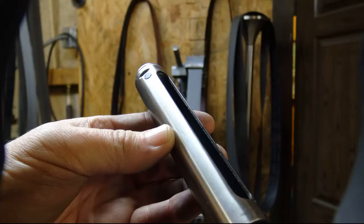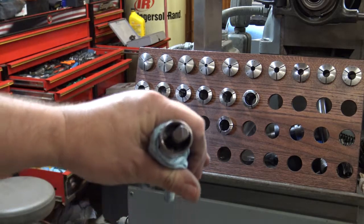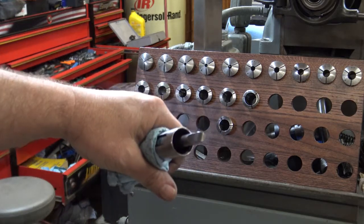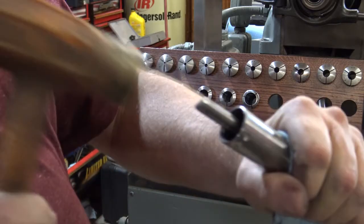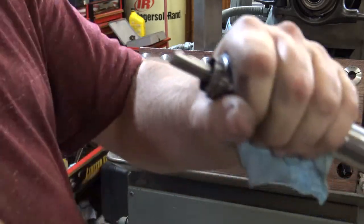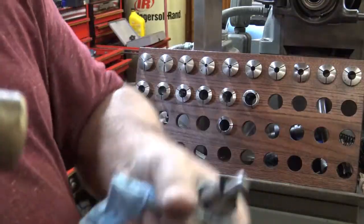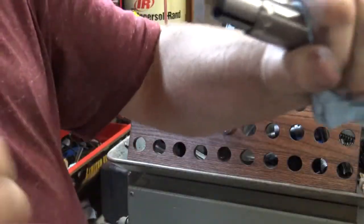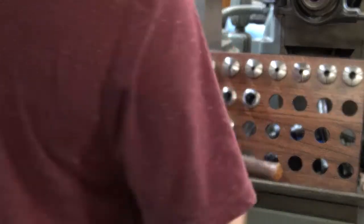This is a before shot, before I start machining on the cocking slot in this piston. This is just a little quick how I get the piston liner out. You take a bronze tipped hammer, just tap on the back of the stem. It'll walk right out, and then you can grab it with a little shop rag and just pull it out.